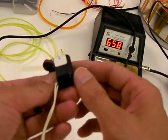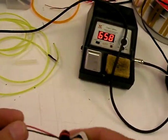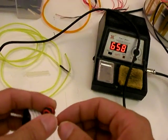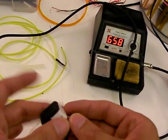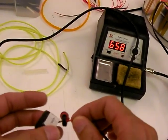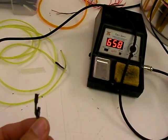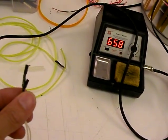This is the 3294BL inverter — that's the one we use. You'll notice this one has a connector that's going to connect to some free channel on your receiver. This is a toroidal core, meant to eliminate any feedback from this AC generator interfering with the receiver's operation. If you're flying 2.4 gigahertz, you don't need this. If you're flying 72 megahertz, you probably do, because this is probably putting out some hertz rate that's going to interfere. Out the other end of this inverter are the leads — an AC set of leads. This one has two separate connectors that connect to pieces of EL-wire.